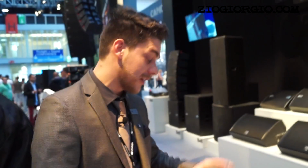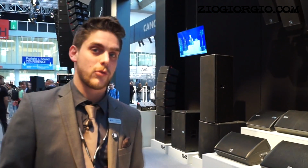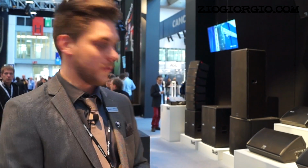Then to this we can decide to match a dedicated subwoofer and manage a crossover point. We have a lot of equalization filters inside. We have stage alignment and time delay functionality, so a lot of DSP power calculation is built inside this new amplifier, which are actually the main news from DB Technologies R&D department.